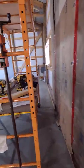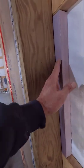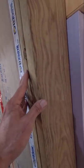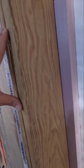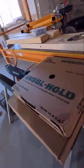Just a quick little video to show you what's going on in the shop. The last couple days I've been cutting and installing this inch and a half XPS foam and putting it behind the columns. What that does is creates a thermal break so that the cold air doesn't transfer through the column. Tomorrow I'll be installing the rest of this stuff.